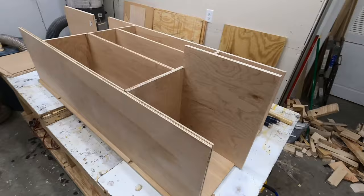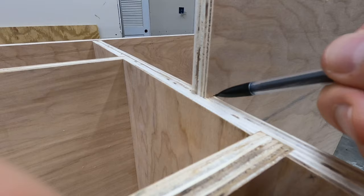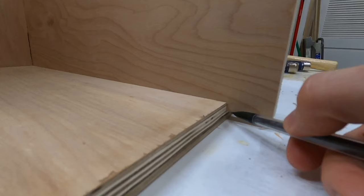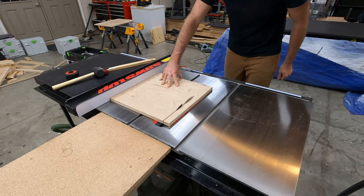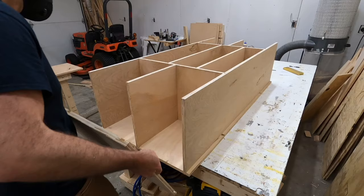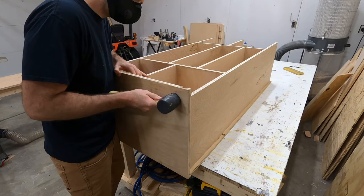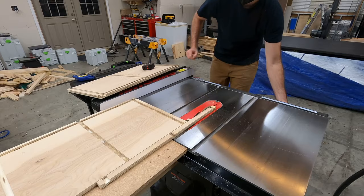With all the grooves finally cut, I wanted to test fit and make sure that everything did fit into place. Rather than try to measure these panels and maybe be off a little bit, I popped them into place while they were still oversized, marked where they should end, and then trimmed them to length afterwards. I did the exact same thing with the exterior panels — just pop them into place, mark the line, and then they can be flush cut.